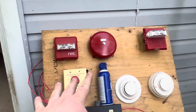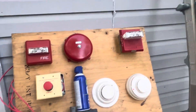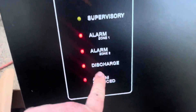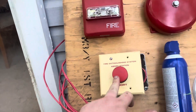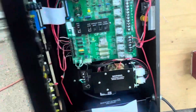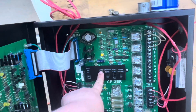As you could see, the bell went off for the first alarm, then the horn strobe went off in a pre-discharge fashion and then went into a continuous tone once the discharge came on. That strobe is hooked up to the discharge circuit right there, and it'll continue to flash until it is powered off. This abort button doesn't work because the system has already discharged, so I'll demonstrate how it would work if you actually wanted to use the abort.